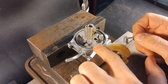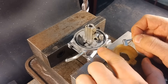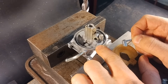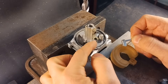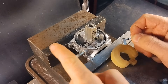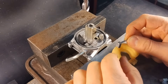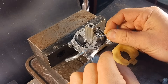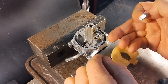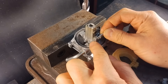I already got it set up in the mill. I've been thinking about this for a few months. I'm thinking to mill off the broken one all the way down, drill and tap a small hole. There's no passage right below this — the fuel passage for the inlet to the seat is in front of it. So I'm hoping to mill this off flat, drill and tap something very small like a 4-40, screw a cylinder down on there with a stud, and then drill a new hole through so that cylinder has a hole and acts as the new end to support that hinge.